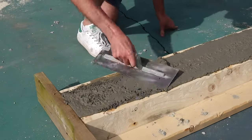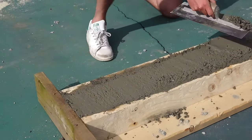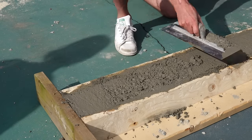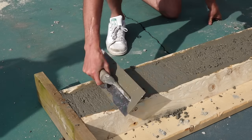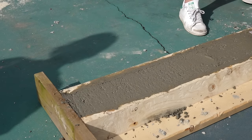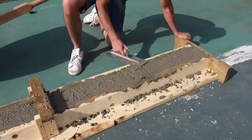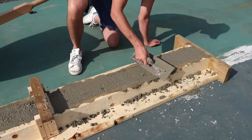Next it's time to screed it, which I probably should have been doing the whole time — you can see the concrete around the edges where it's touching the wood has had a lot of moisture pulled out, so it's dragging in those spots. I also probably should have been using something more like a mag float or a block of wood, but I was just working with an old drywall trowel that I had kicking around. By the end of it I did manage to get it screeded off well enough.